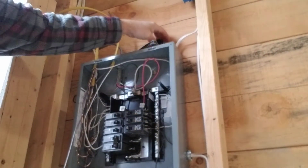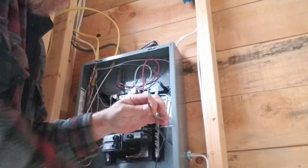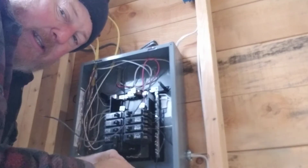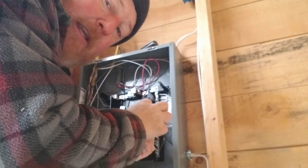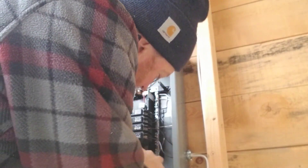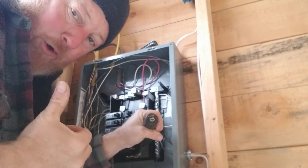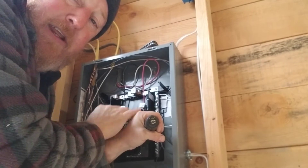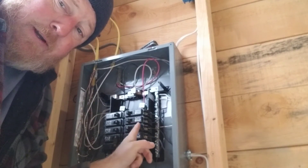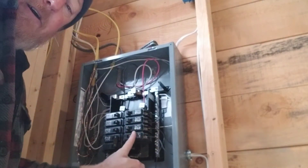We've landed that neutral on the neutral bus bar, and now we're going to put our 20-amp breaker in. Make sure it's off, run the hot conductor down and strip it and put it in the breaker. In the US in a residential application, a 20-amp breaker requires 12-gauge wire and a 15-amp breaker requires 14-gauge wire. You can use 12-gauge wire with a 15-amp breaker, but don't mix gauges mid-circuit — if someone comes behind you and sees 12-gauge wire on a 15-amp breaker having issues, they may throw a 20-amp breaker in and that could overpower the thinner section of the circuit and cause a fire.